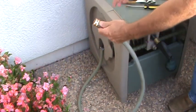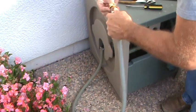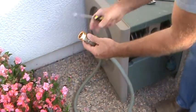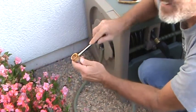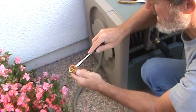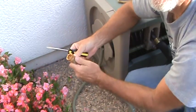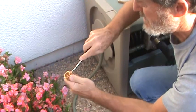How did I cut the hose? If you don't have cutters, you might have to use a sheetrock knife, but you could cut yourself with that. So I just took a hacksaw blade and cut it right off — it works really well. You don't need to have it in an actual hacksaw; just a separate hacksaw blade really comes in handy. I just keep it in my little box of tools. Line that up where it needs to be and tighten it down.